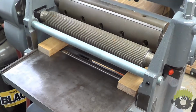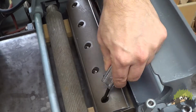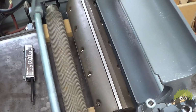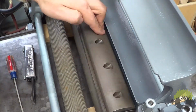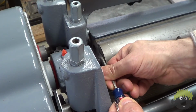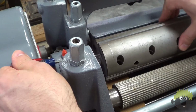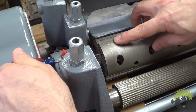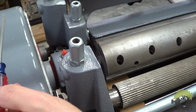The two strips are then positioned at either side of the bed and adjusted so that they just touch the knives. Then I loosened up the gib screws on one knife and rotated the cutter head backwards gently, bumping it past the wood. The idea is that you should end up with both knives being set evenly across their width and to exactly the same height, assuming that your shims are the same height. After setting each knife in this way, I snugged up the individual gib screws.